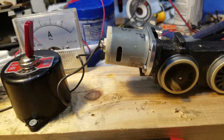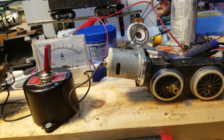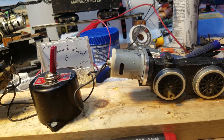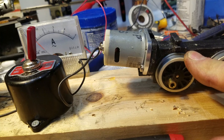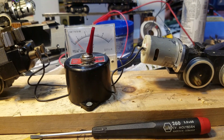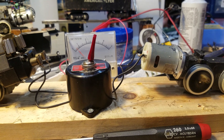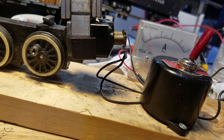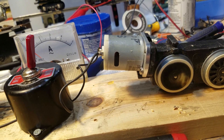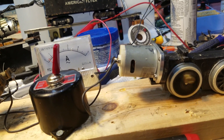Flip back over to my buzz bomb here — I know it's noisy. At 5 volts it runs, but at 3 volts you barely get a rev. I've got to get up to about 4.5 volts to get a good steady run. I can stop it, but it pulls pretty good. Getting it up to 10, 11, 12 — there's flat out, still pulling about 0.4 amps. It's cruising as good as it can.